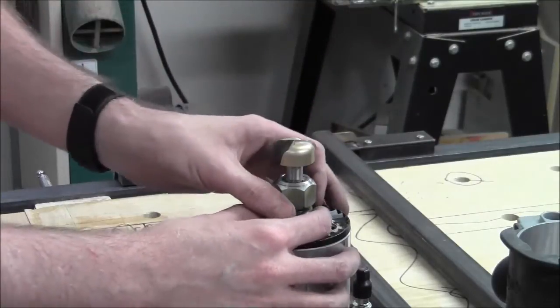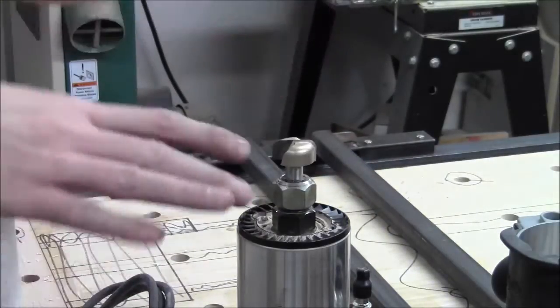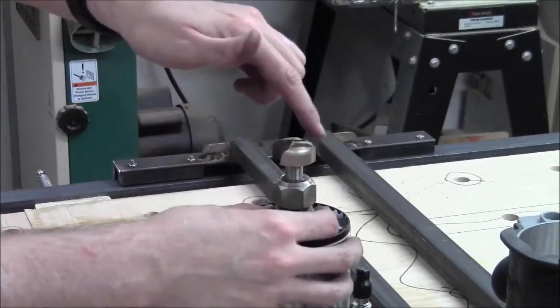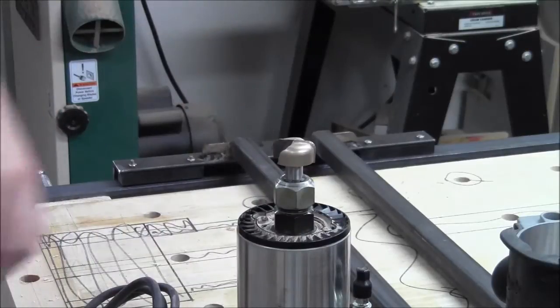It's the same concept as ticking the corners of a hand plane so that when you're making passes on a plane, the passes that overlap, you don't get plane tracks. This is exactly the same kind of thing, where you just use this little radius to blend a little bit more, so there's not as hard an edge there.